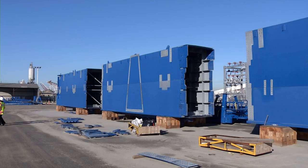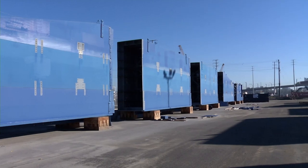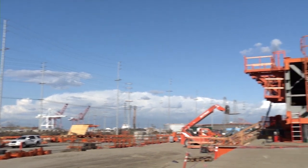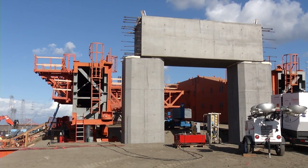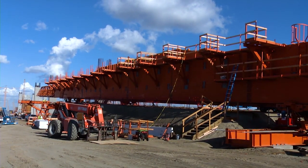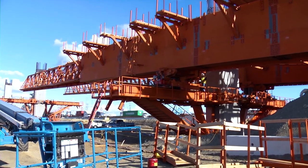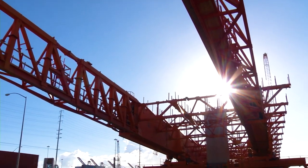We got these miles of shipping containers, so literally building them nut, bolt, and washer from the ground up. We used a little bit of forethought — rather than build it and try to set it up in the air, we readjusted and put it at the low abutment at abutment one, and we built up the soil beneath it so that when we were putting everything together we weren't way high up in the air — we were down near ground level.